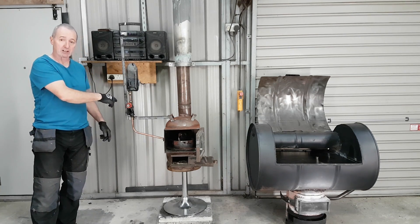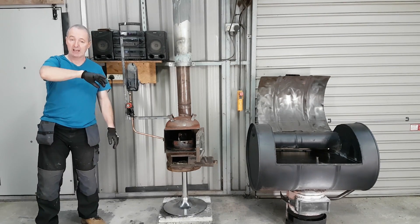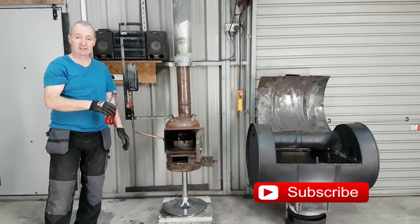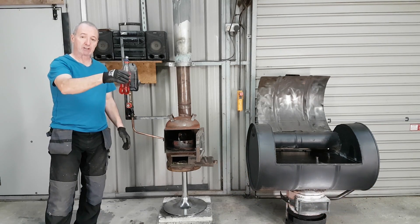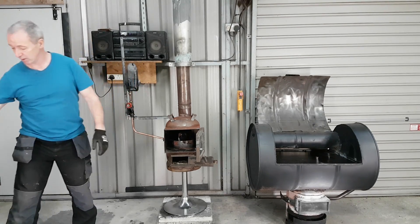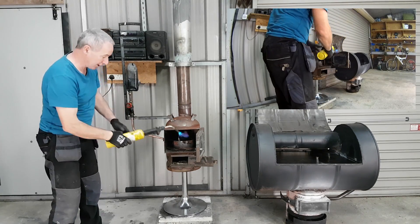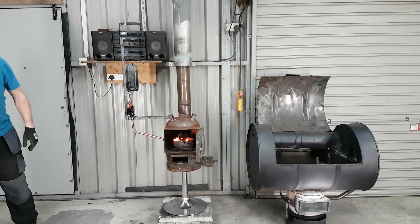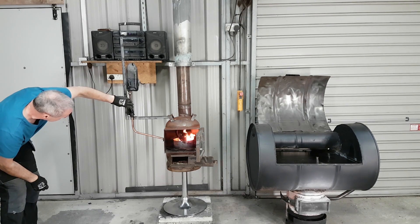I just tacked on a couple of pieces of angle iron so that I could hold this in the air and make it a drip feed system. This could be anything you want — it could be a big tank or a small tank, and it should really be remote away from this, but I wanted it portable. Kerosene is less flammable than gasoline — I wouldn't dream of using petrol or gasoline in this sort of thing. Also, if the stove is hot and you put kerosene in, it vaporises and you could end up with a bit of an explosion. So into a cold stove, no problem. A turbo torch is great for getting this thing lit. So that's the kerosene in there lighting now — I haven't introduced oil yet, so I'm just going to introduce some waste oil. That's gone down into the chamber now.